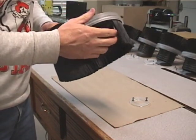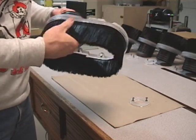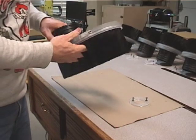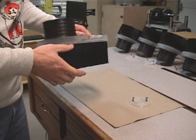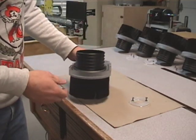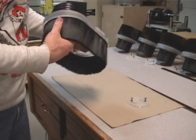One of the big problems with dust collection with the boot is simply being able to change router bits, and the other problem is having clearance for your clamps. You tend to want to hit clamps with all this stuff hanging off your router. This shoe has a three-inch length brush, which allows a lot of clearance for clamps.